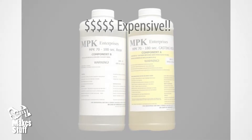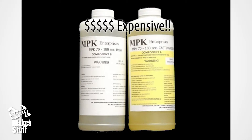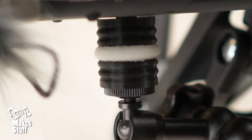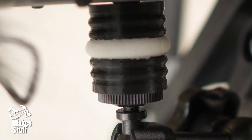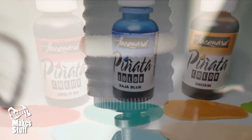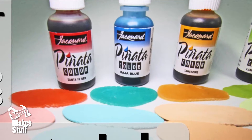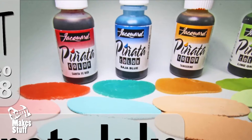Now to my interesting discovery. Originally my plan was to buy some two-part molding silicone online, and during my search I happened onto an Instructable that used normal household silicone mixed with corn flour to turn it into castable silicone. So I started experimenting. The first test, when I mixed just the silicone and the corn flour, set in 15 minutes. But the next test, when I added some alcohol-based dye to the mixture, took a day to set and produced an almost gel-like silicone once set.